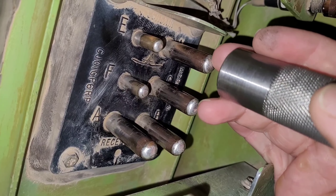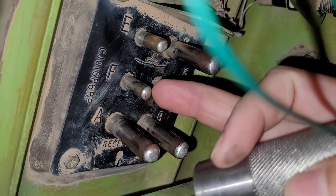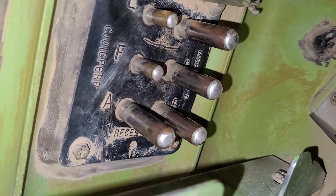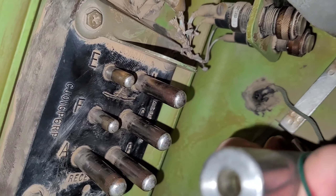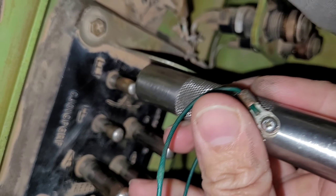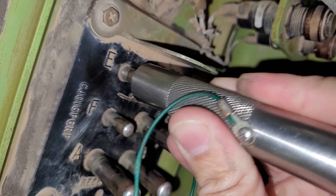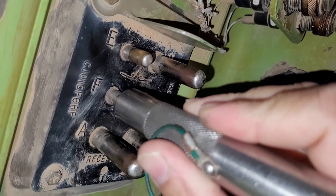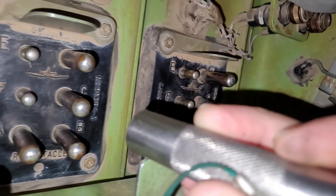It is just touching the tip — it is not going the half inch or 12mm. For the smaller pin we'll take the dash-3. This is the dash-3 for the smaller pin; the dimension is the same, it should not go beyond 12mm or half inch. This is good. The same will be done for this side.